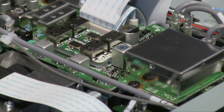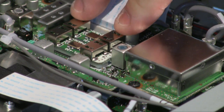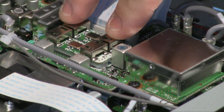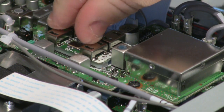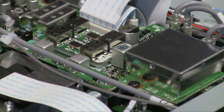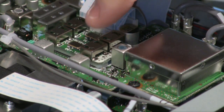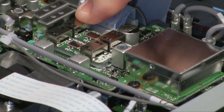The filters are now in — you can see them on the filter board here. The 3kHz one is here and the 6kHz one is sitting next to it. They just go on little connectors and literally push onto the board and sit there quite nicely. So you've now got 15kHz, 6kHz, and 3kHz roofing filters installed.